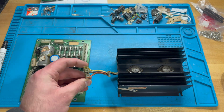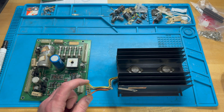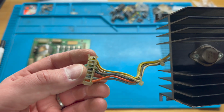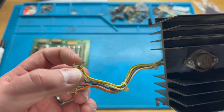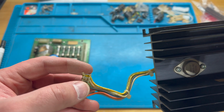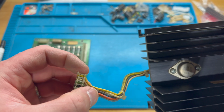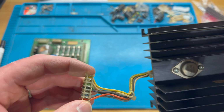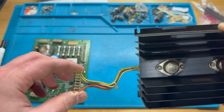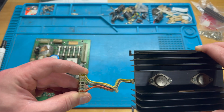And this is called an IDC, which stands for Insulation Displacement Connector. If you can kind of see this, maybe I can bring it up real close. You see the wires are kind of passing through the top, and they look like they've been cut on the side. Essentially each of these connections has sets of teeth that bite through and pierce the insulation of the wire and make contact with the actual wire on the inside. And then that goes through to the female pin, which connects to the male header pin.